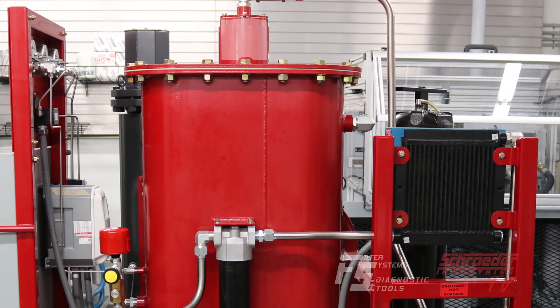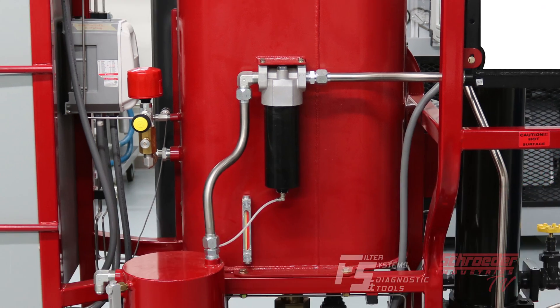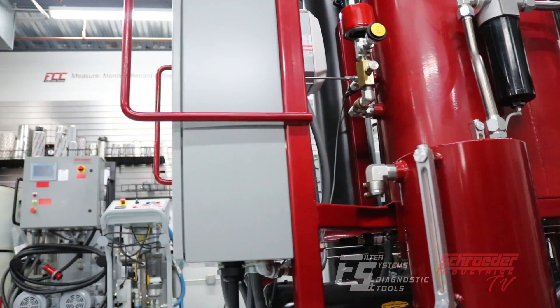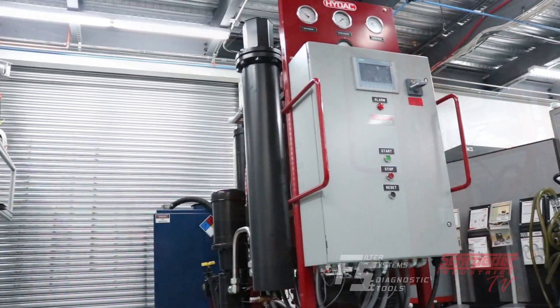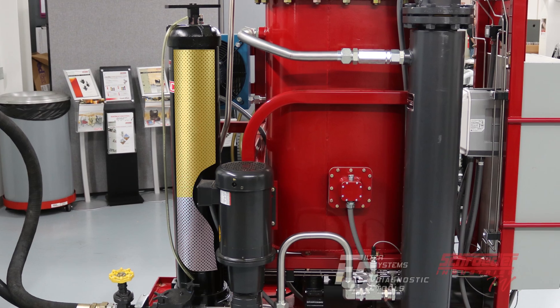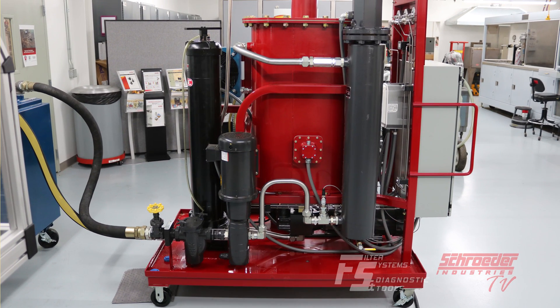The warm moist air is drawn from the reaction chamber by the vacuum pump, passes through an air cooler which condenses the water vapor back to liquid form, and the liquid water is collected and stored in the condensate tank. The fluid discharge pump then pulls the fluid from the reaction chamber, pushes it through the particulate filter, and the conditioned fluid is returned to the reservoir and the cycle is repeated.